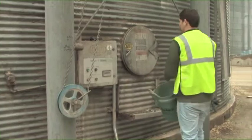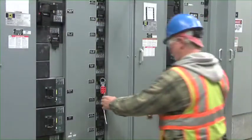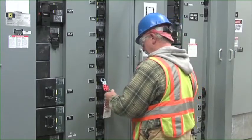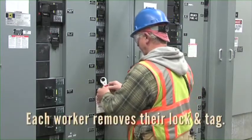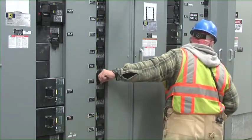When the work is completed, remove tools and equipment and make sure all personnel have exited. Whoever initiated the lockout tagout procedure should ensure that this task is completed. Notify other workers in the area that work is completed and the equipment will once again be energized. Caution people to remain out of the vicinity of any danger should startup not occur properly.